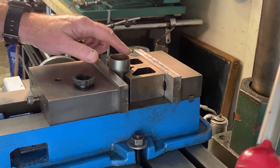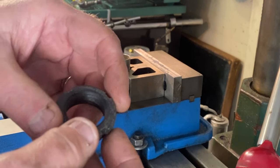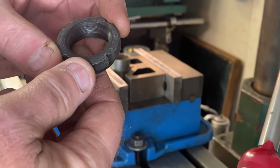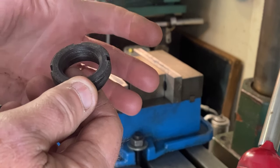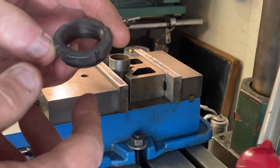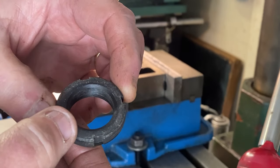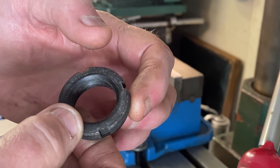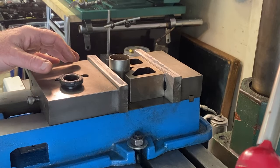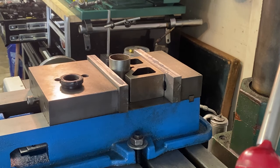In this case, what we're going to do is pick up the center here, and take the width of these slots that the little tang would go into for a typical spanner nut application, and we'll offset the mill off the center, depending on what the size cutter is, plus half the diameter of the cutter. And then we'll essentially relieve these areas here. We'll relieve this, and this, because we're going to be cutting on either side of it in two axes really, Y and X. So that's what we're going to do. It's going to be a pretty simple job. That's the objective. You'll see really what I'm talking about here as I do it.